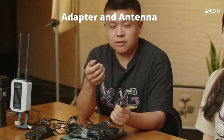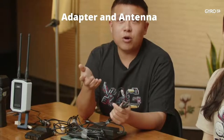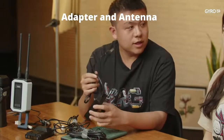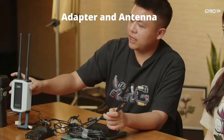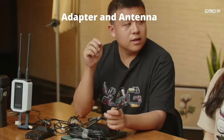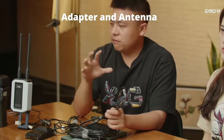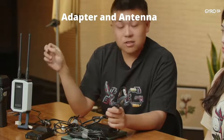The second reminder: you cannot use a laptop power bank. You need to use a mobile power bank with a city power socket to charge through the adapter. The power consumption of the LNT is 36 watts, so when buying a mobile power bank, you need to watch this number and do a calculation.